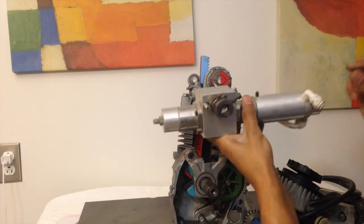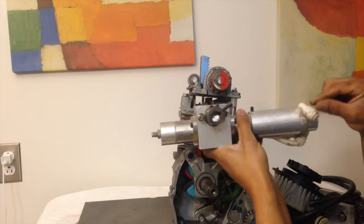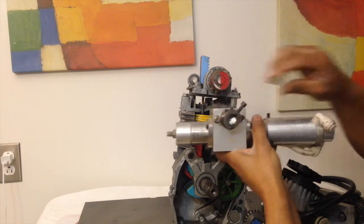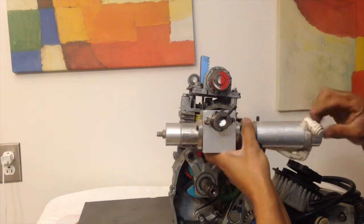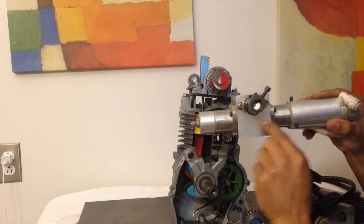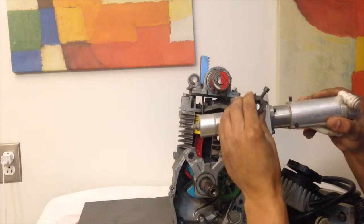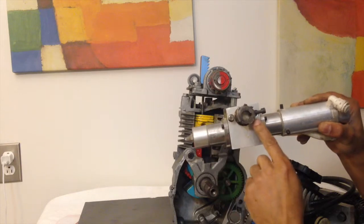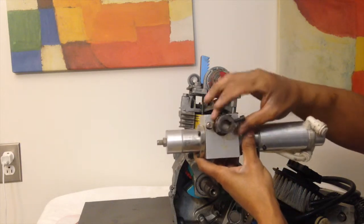The only way you can use pressure directly is hydraulically. One drop of water — whatever PSI you're pushing — you convert that into movement. If you push one cubic inch of water inside, and the cylinder is one cubic inch, it's going to rotate with a certain range of force. Whatever amount of pressure you put in, you're going to transfer that force directly here.